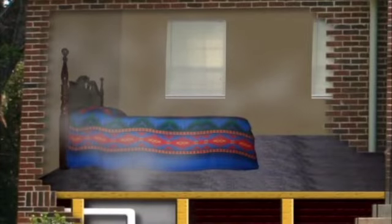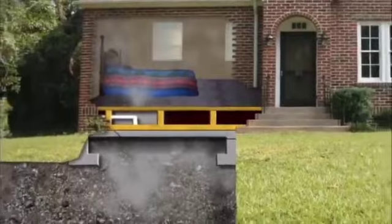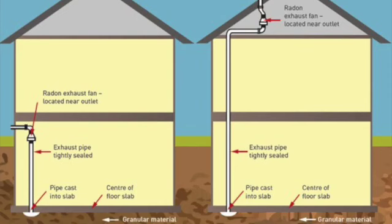With a radon system, you create a cavity of low pressure underneath the slab to where radon will preferentially move, and be sucked up into the pipe and exhausted out the side or out of the roof, wherever you choose to do it.